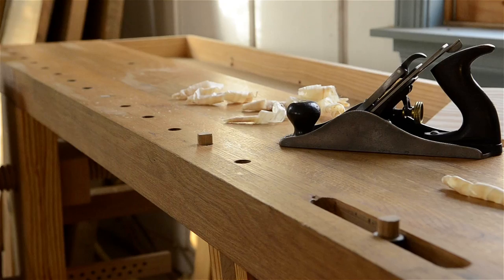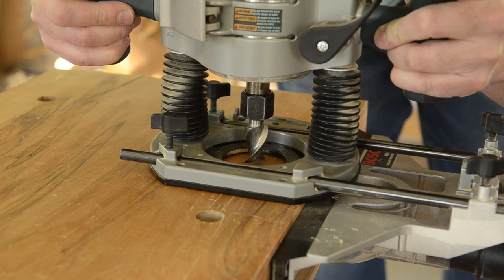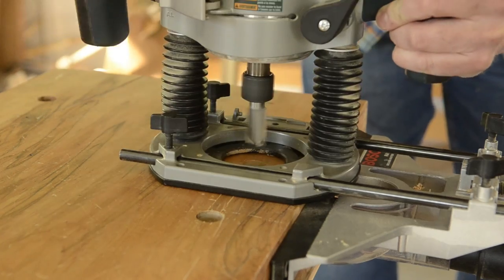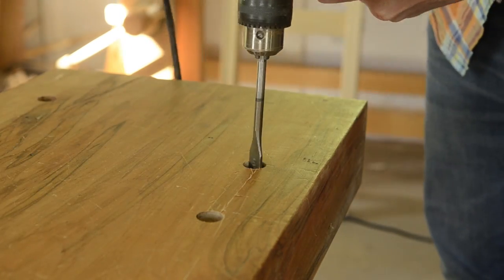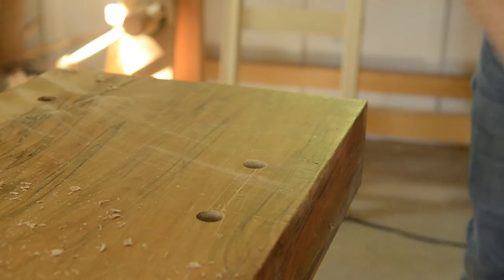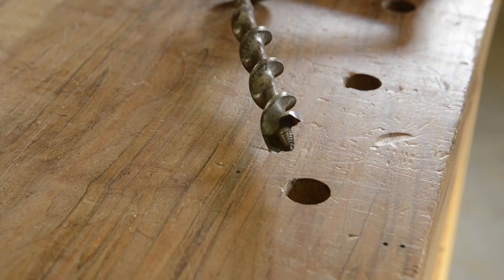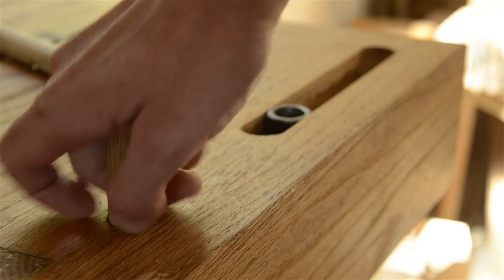Just a quick tip: to make a lot of consistently sized bench dog holes and also hold fast holes, I use a plunge router with an adjustable fence and plunge as deep as I can with a three-quarter inch or one inch spiral up-cut bit. It's super easy to just move down the bench as you plunge the holes. Then I finish boring the hole with a spade bit in a powerful corded drill. You can certainly do this with a brace and bit, but be prepared for it to take a lot longer and for holes that aren't quite as tight because of some wobbling.